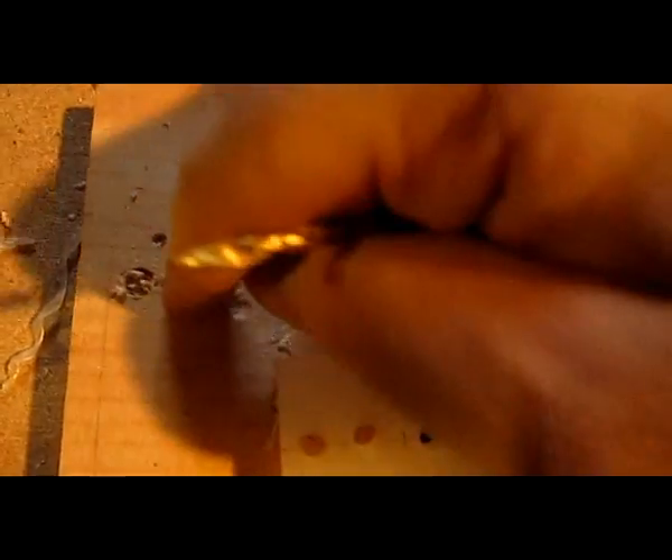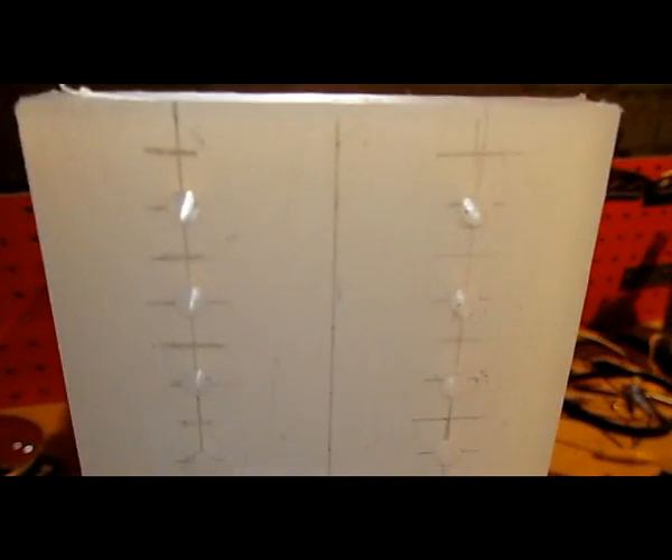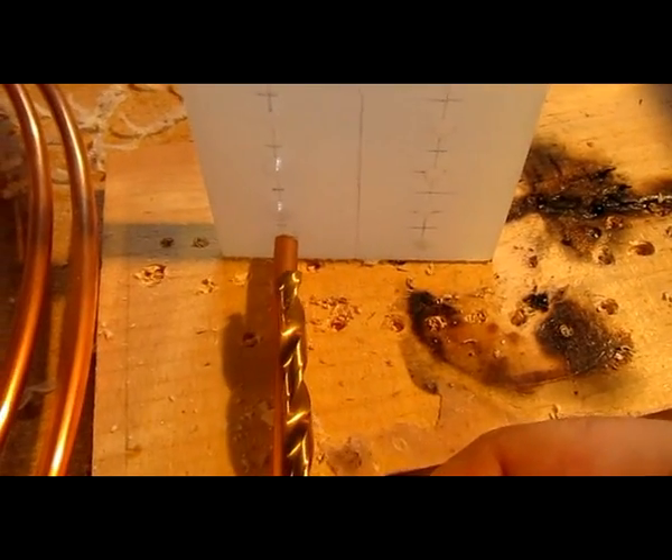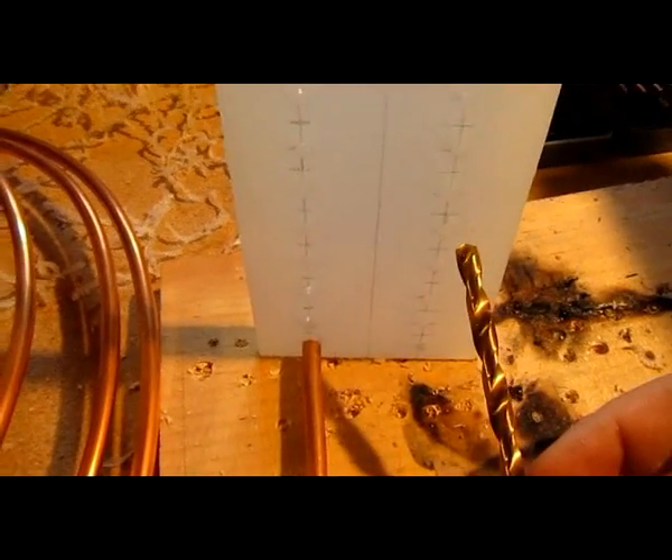You can see how the holes are not quite up and down even, and it's a good thing I'm using this backboard because yeah, it goes all the way through. There are some pieces of plastic that spiral up around the drill bit. This is where a drill press would make nice even holes, but I've got to do what I can with what I have. We've got all of our pilot holes drilled all the way through. Here's a piece of that copper pipe — you can see that it just fits right inside that hole. Now we'll use the larger drill bit to widen out all these holes to the proper size, give it a good wash, and then do our long line cuts.